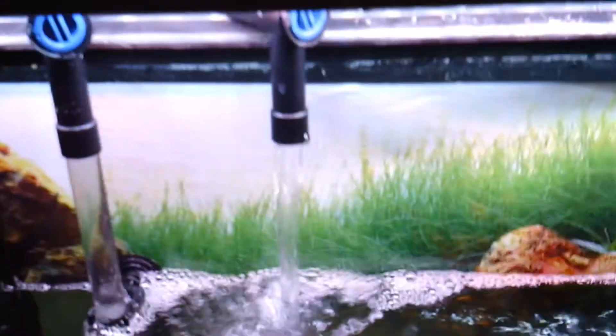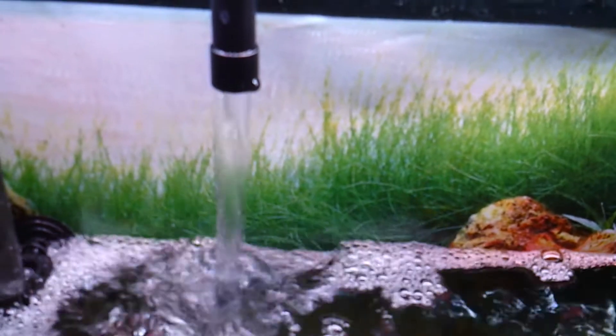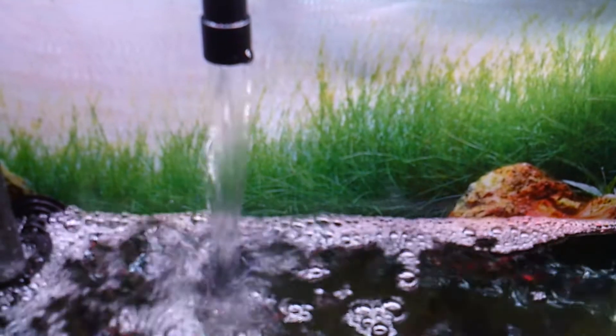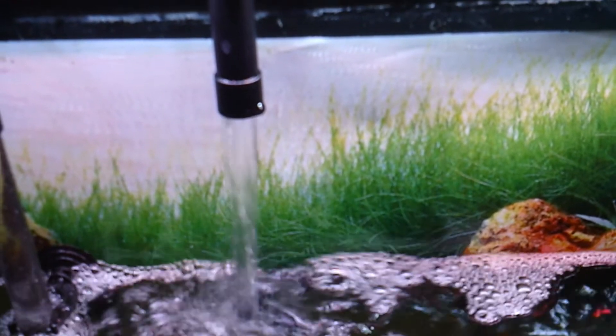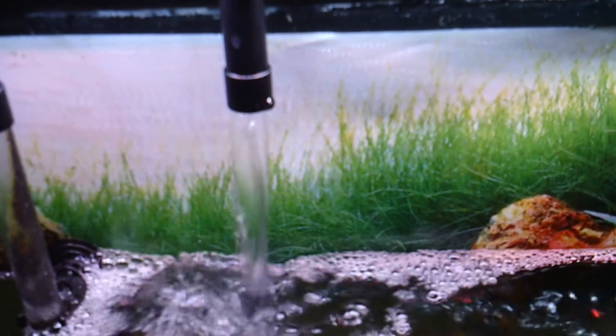Here it is actually on the tank. This tank is 51 inches tall — I just measured it. I wanted to know what this flow rate was, so I took this measuring cup, which is a quart, and stuck it under this output. I did it five times and then averaged them and got six seconds. So that's six seconds per quart. If you do the math right, which I hope I did, I got 150 gallons per hour — one quart of water in six seconds is 150 gallons per hour.